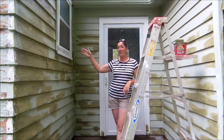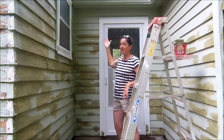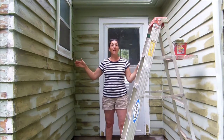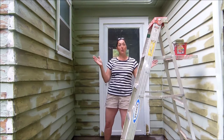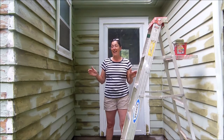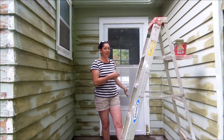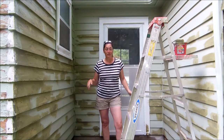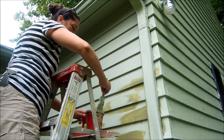One of the best things I learned when doing the tall part of this house: they have wings or expansion wings for your step ladder for about forty dollars so that your ladder can't tip one way or another — it holds steady against whatever surface it is propped against. We'll get started and I'll talk about tools, brush strokes, paint, and primer.